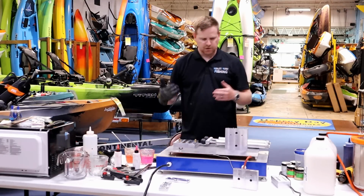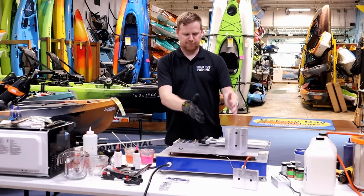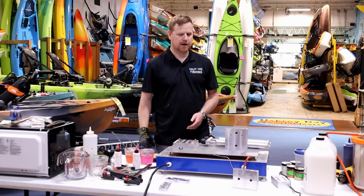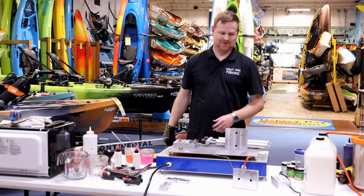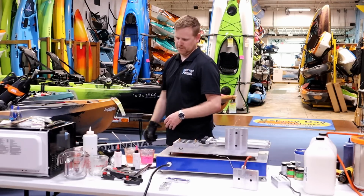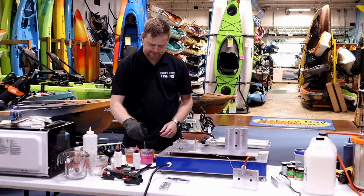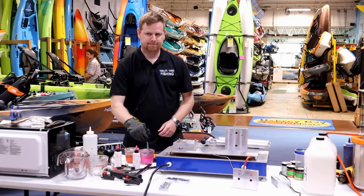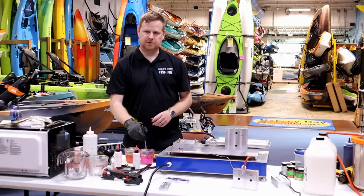As you can see, most of the time commitment is in the prep, in getting things ready for the injection process. And it's sort of the opposite for hand pouring. The time commitment is doing the actual pour, placing the color, and then letting it cool down. You have to let it cool down before you can pour the next color. But when you do that, you'll see that even though it's already cooled, the other layer will still stick. It's all a game of timing and temperature with the hand.